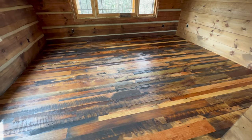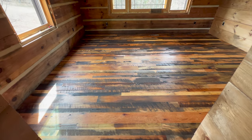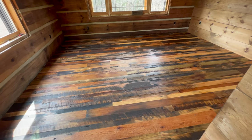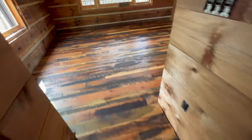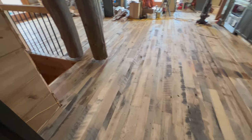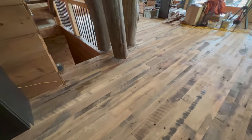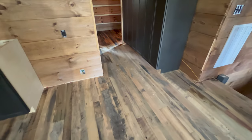The first coat is finished. I have to wait 24 hours for it to dry and then I'll apply the second coat, and then it takes about seven days to cure. It looks really nice. So I'm going to start making my way out into the living space, putting the oil on, and making a rule that nobody can walk in here unless they're wearing socks — which will be very interesting to see how many people actually follow that rule.